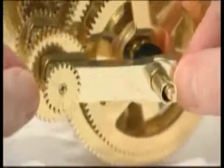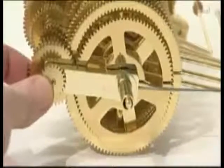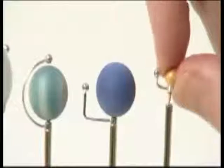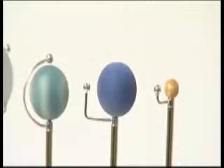Add the small gear sandwich, mesh the gears and lock the collar with an M3G grub screw. Lock the Pluto support arm into the side of the collar with an M3G grub screw. Push the pin of planet Pluto through the collar of its moon and into the top of the vertical support arm. Phase 9 is now complete.